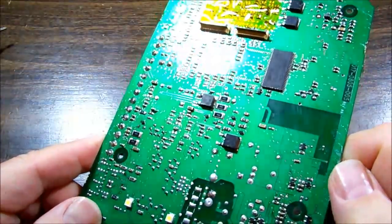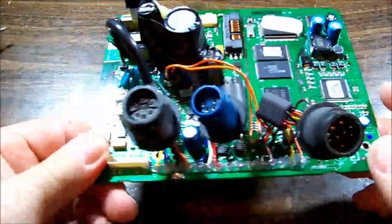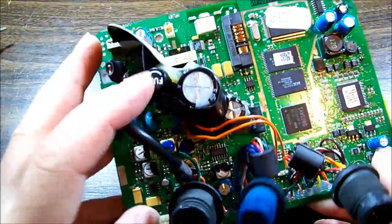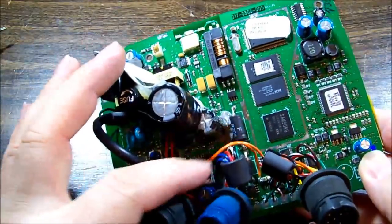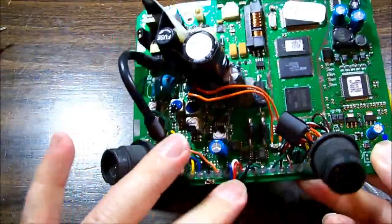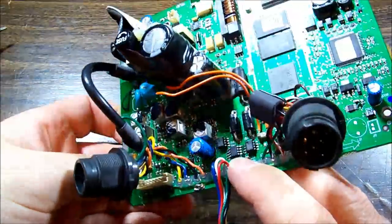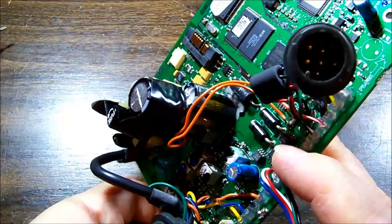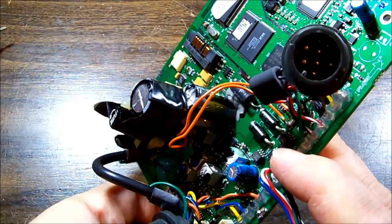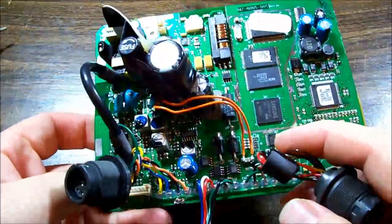So now we need to follow where our fuse attaches. Well, we need to follow through that input circuitry down there. Yeah, I don't think we're looking up here. The fuse is mounted up there, which threw me for a bit till I found out that that's actually those. So we're looking down around the bottom, I think. And possibly there's a surface mount IC there, which has a number of MCP 2551, I think. Possibly. We'll get a closer look at that.